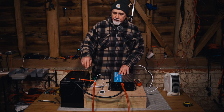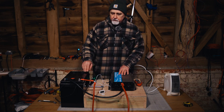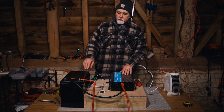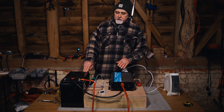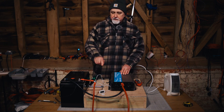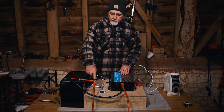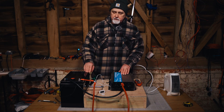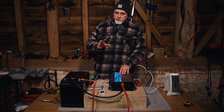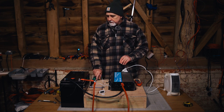What we've done now is changed to one single positive line with a connection here with a temperature probe stuck onto it. We're going to run this for 10 minutes, torqued to 10 newton meters. We're expecting negligible heat buildup at 10 newton meters. Then we'll loosen it, torque down to eight, then six newton meters — and we may even go down to four newton meters in increments of two.